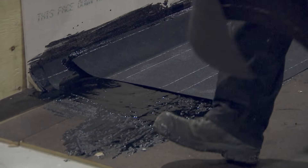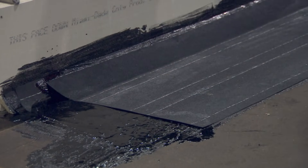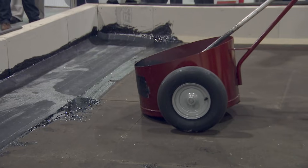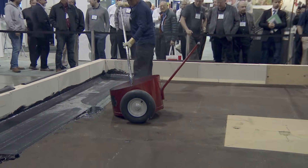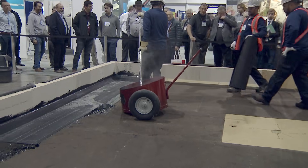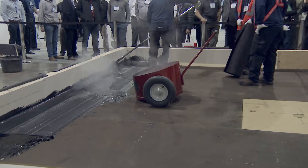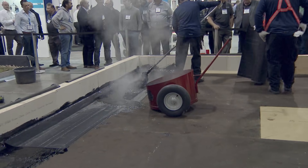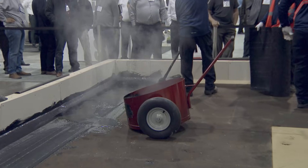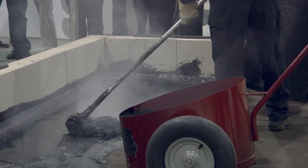A fish mouth is simply a little lip. If you get a fish mouth, you have to cut it and put a two-ply system over top to fix it, otherwise it could leak. Now they'll do a full roll. When you go back to the corner up to flashing, you'll see when you cut it and take it apart — you dissolve the asphalt — in testing we'll have four plies. That's a true roof that we're looking for.